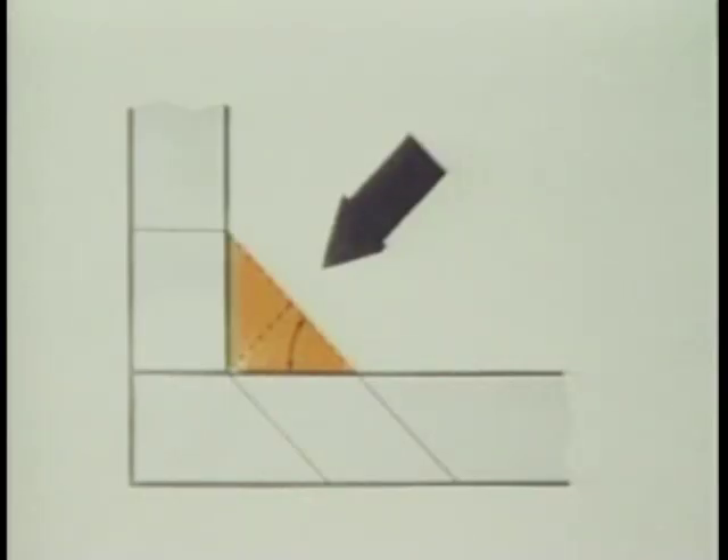To measure throat thickness, a welder must determine weld leg sizes. If three-eighths of an inch fillet size is required, use the 707 thousandths times leg length formula in determining the throat thickness. For example, 707 thousandths times 375 thousandths equals 265 thousandths. Round this off to the nearest fraction in one-sixteenths of an inch, which would equal 250 thousandths, or one-quarter of an inch throat thickness.